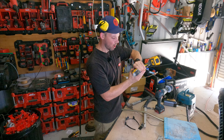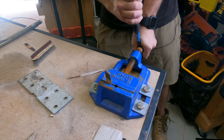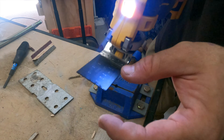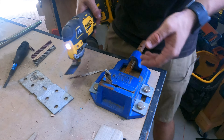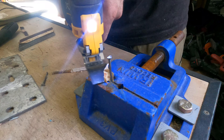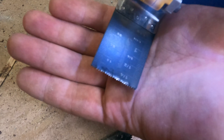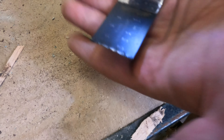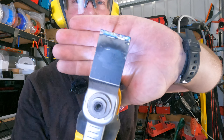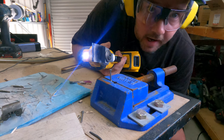Let's try the bi-metal blade — that's going to be hot. It says bi-metal. We're going to go through a couple of nails, maybe five — something nice and easy. I know these do get through nails so it shouldn't be any problem. I do recommend doing it on a lower speed with all these cheaper ones, or even any multi-tool blade — I find it does last a little bit longer. There is a little tiny bit of damage on that, but you'd be able to keep going. We'll destroy these — go straight to the metal. That's definitely no good.